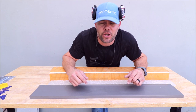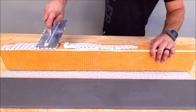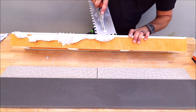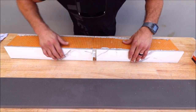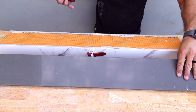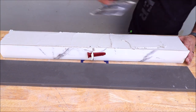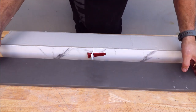We have all of our pieces, let's install. It's time to install the engineered stone curb top. This is how we like to do it — screed the top like this and back butter the bottom of the stone.